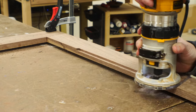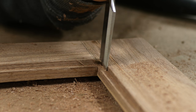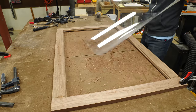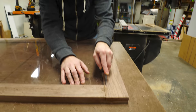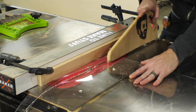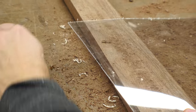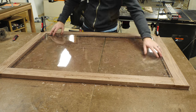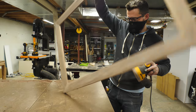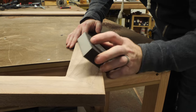After the glue was dry on the frame, I flipped it over and clamped it down to the table so it wouldn't go anywhere. Then I put a big rabbeting bit in my trim router and went all the way around the inside edge. The router leaves a rounded corner, so I squared those up with the chisel. After that, I laid in my plexiglass and marked where I needed to cut it to make sure it was a nice tight fit. Thin material like this slips underneath my table saw fence, so I clamped on an edge to keep it in place. The table saw does cut, but it also kind of melts the plastic, so you end up with a rough edge — but you can usually just scrape off the melted plastic. I used an orbital sander with 220-grit to smooth off all the surfaces and clean up where the half lap joints met up on the outside. Then I used a sanding block to knock off some of the corners to make it a little smoother to the touch.